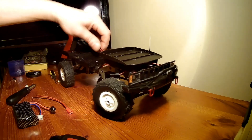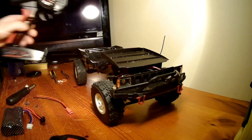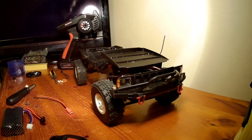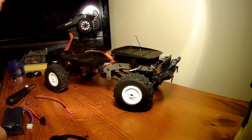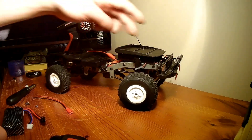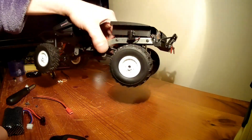And there you have it. Got the motor connected with the new JST cable soldered on, got the ESC plugged into the receiver, got the servo plugged into the receiver, and we're now running hobby-grade electronics. In my opinion it's the best upgrade you can make if you're converting a ready-to-run. I wouldn't recommend going out and getting a bigger motor or metal driveshaft quite yet — I recommend getting yourself a 20 amp ESC, hobby-grade receiver, and a transmitter of your choice. There's loads out there, and it makes these trucks a million times better.